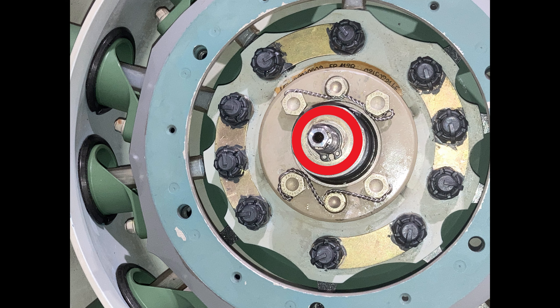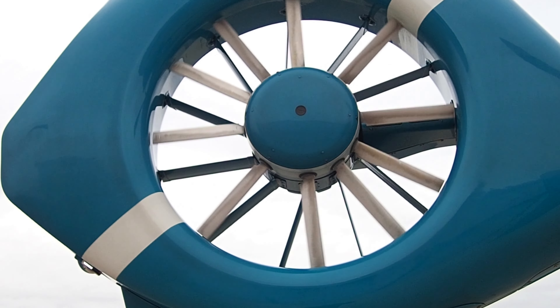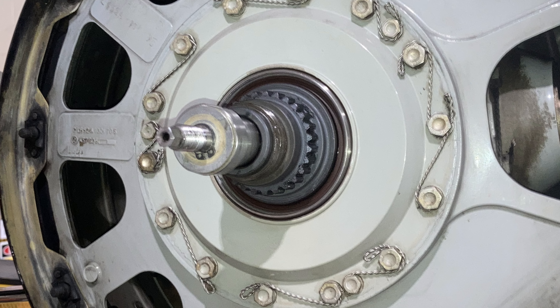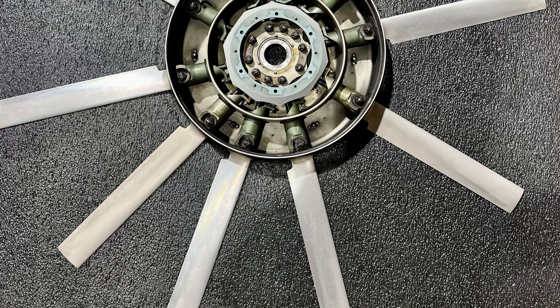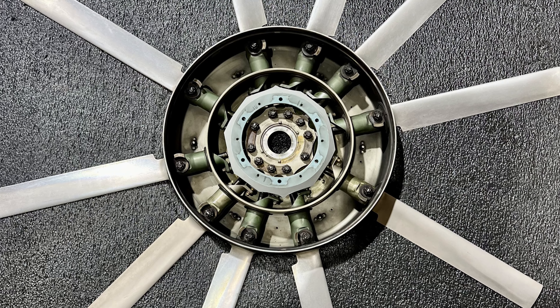Taking it off is easy; putting it on isn't really that difficult either. Clean the tail rotor gearbox, clean those splines up pretty good and take a quick look at it. You slap the tail rotor on — it's on the output shaft. All of this is in the maintenance manual; you've got to go to the manual. I'm not going to go through any torques — just a quick once-over on how to put a tail rotor assembly on. It's not difficult, but there are some specific things you're going to need to read in the manual, like the torques and how to torque the stuff down.